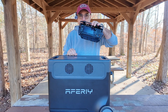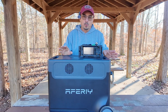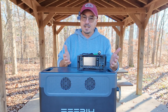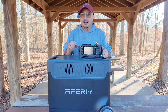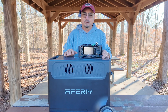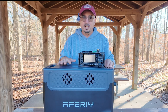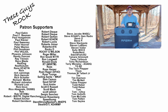On one hand, I think it's a little bit ridiculous to take a 705 and power it with a power station this large. But it is sad to see that we can't get clean power out of this thing that won't produce any RFI. I also suspect that if we move this power station a little bit further away from our radios, it probably wouldn't be that big of a deal — I had the antenna sitting right beside this unit. But if you connect that power cord to the radio from the power station, it looks like we're just going to be stuck with that RFI. That's not really where I plan to use this unit. My primary use case is going to be to power the RV itself and then run the radios off of a separate lithium iron phosphate battery. What I'd really like to do is have this along with the two additional batteries sitting in the back of my truck so that I could run the RV for an extended period of time off of this power station. If you found today's information helpful, be sure to give us a thumbs up. We will see you guys on the next one. Until then, 73.